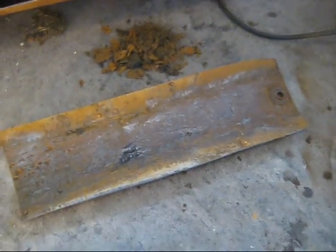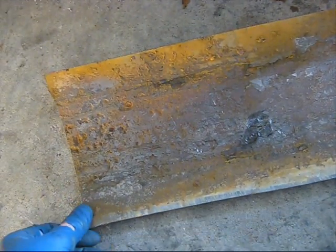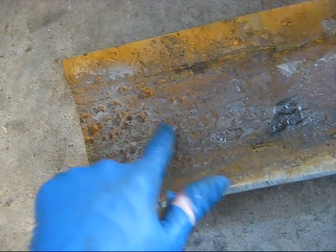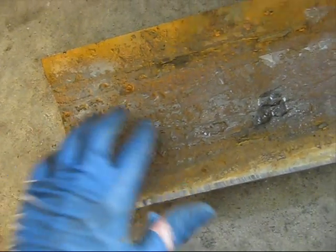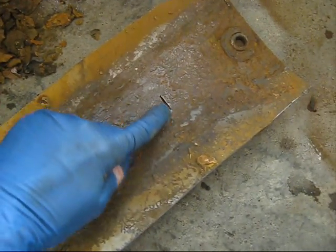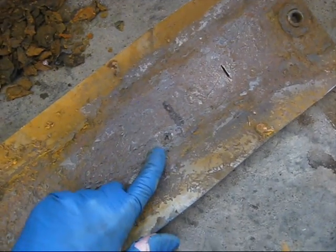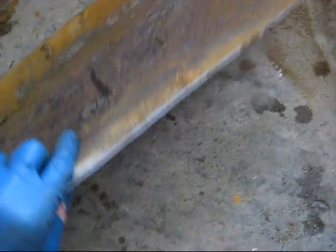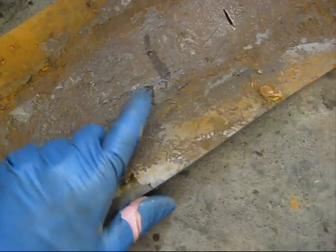I took a wire wheel to it and made a huge mess in the process. I got it clean enough so you can see exactly what kind of damage has been done. All of this is just pitted. This pitting means it's going to be weaker in these areas, and when you have a pressure vessel, that's a big problem. This little slot right here is just from where I cut the wheel support off. But this right here — see that hole? That's where the pinhole was before. It's gotten so thin right here that when I hit it with the wire wheel it just started opening up.